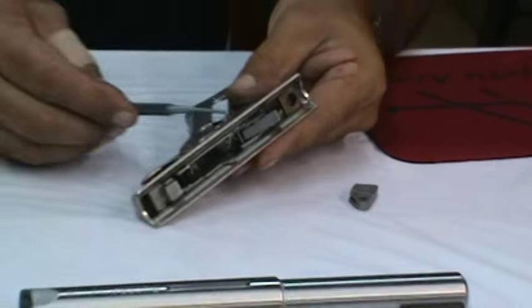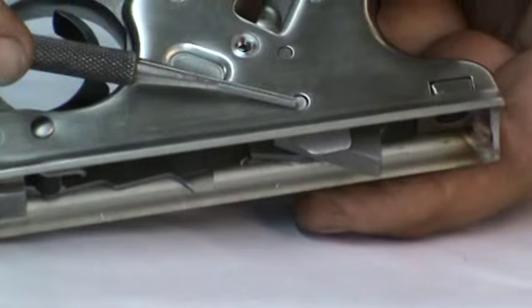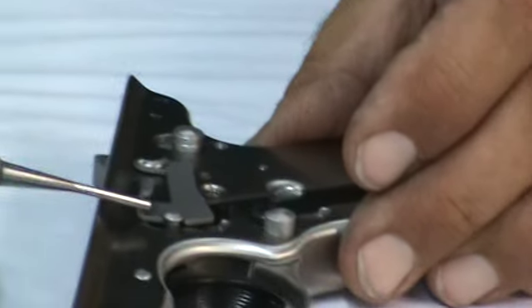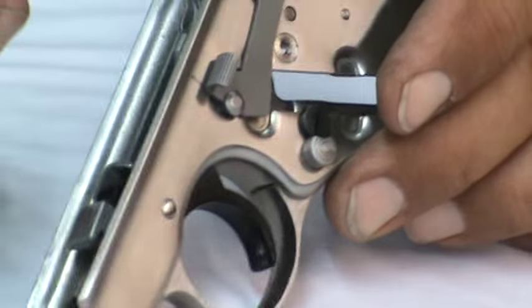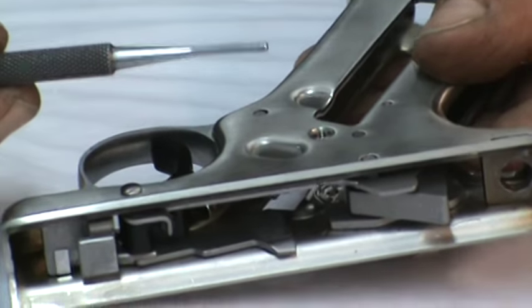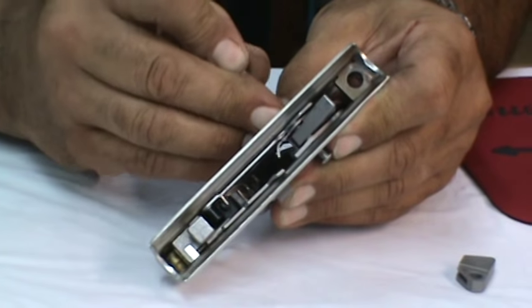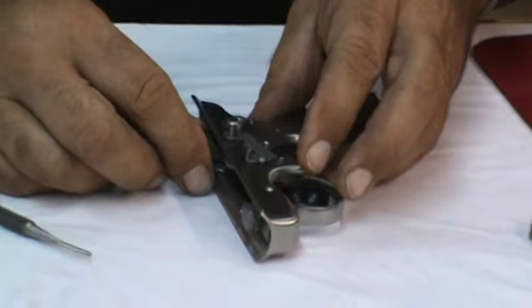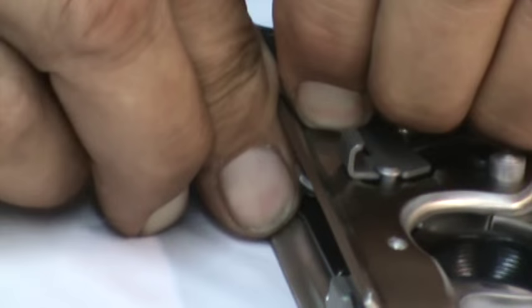The difference is the dedicated Mark III kit hammer will have a relief cut on the right side to incorporate the components that make up the mag disconnector. This pin right here is what the hammer pivots upon - it comes through the frame on the left side, goes through your bolt stop lever, through your frame, through your safety, through the hammer and rides flush on this side. These pins usually fit rather loosely, so just push on the pin, grasp the hammer, work the pin out just far enough to release the hammer and let it out of the frame.